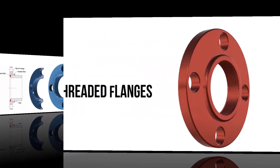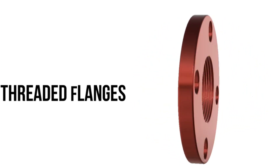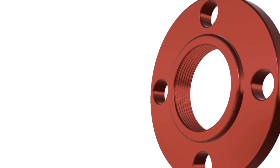The next type of flange is a threaded flange. The threaded flange design, also called a screwed flange, uses a screw thread to connect the flange to a pipe. A male thread is cut onto a pipe end whilst a female thread is cut into the bore of the flange; the male threaded pipe is then screwed into the female threaded flange. Even though the threaded flange design is available in many sizes and pressure ratings, it is mainly used for small-sized piping systems, i.e. less than or equal to 4 inches. Due to their lower pressure applications, threaded flanges use flat and raised faces only.